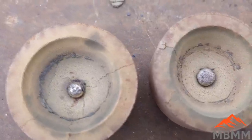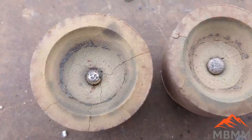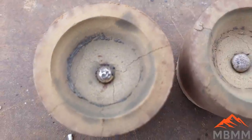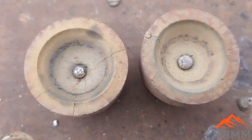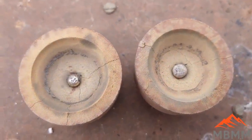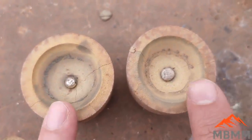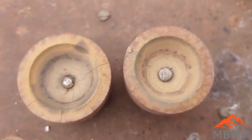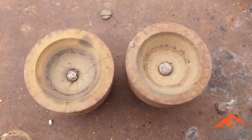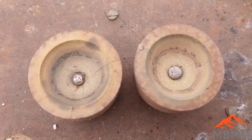The bead is kind of pulled up into a bead form. It has a lot bigger convex surface on the top and a little bit better finish. But I'm going to take our two beads now and put them together and do a final cupel on them and see if I can get a real nice shiny silvery gold colored bead. They're also both about the same color. There's definitely some yellow to them, but I do believe there's some silver in there, probably 60% gold, 70% gold, somewhere in there.